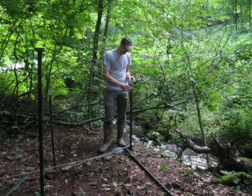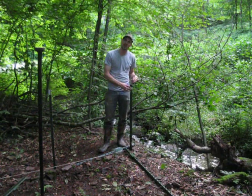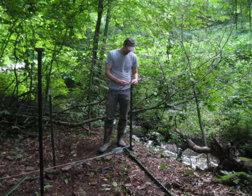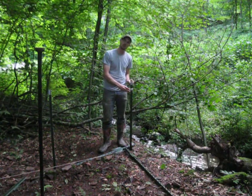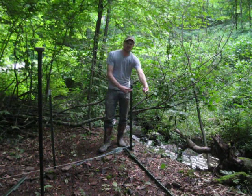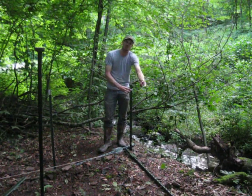Make sure your lock is oriented the right way. The lock always goes on the longest leg of the T-post — it won't work any other way. Regardless of which way you orient all this, make sure you put the lock on the longest leg of your T-post. And make sure those little squares sticking out are at the top. Because I'm going to be coming in with another brace, I'm going to put this one lower down, and that way it'll give me room to do my second brace.